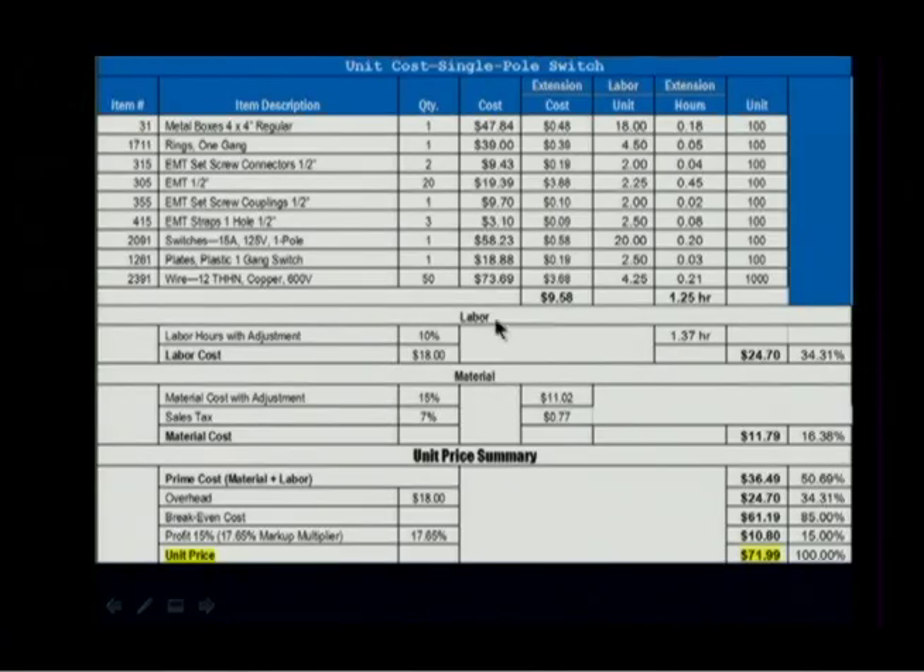Let's assume we had included a fixture in here. If I included a fixture, I would have increased my material costs, done my markup, and come up with a total selling price. Then if you're supplying the fixture, I'm only going to find out what the dollar amount was for the fixture and pull it out. I didn't change my profit margin dollars. I didn't change my overhead. I'd put a line item below that says 'supply by owner,' then take the $71.99 and minus that number. That way I still have my profit and overhead in the job — I don't care whether you or I supply the fixtures, because I'm not making or losing any more money.